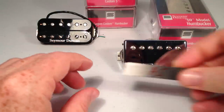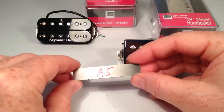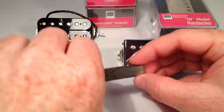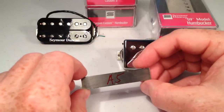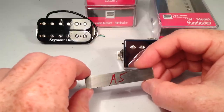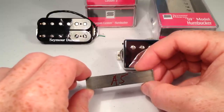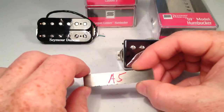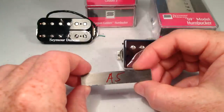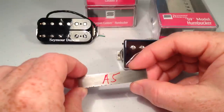Next up is probably the most common magnet used in humbucking pickups — this is A5. It's got a fairly high output. It's got a lot of treble content, a lot of bass content, and the mids are fairly scooped. It's got a bright, clean tone to it and a fairly big bass that remains tight — it's not as loose as the A2 magnet pickup. And you can really use A5 to get a wide range of tones, from something extremely vintage to something extremely aggressive and modern. So it's a very versatile magnet.